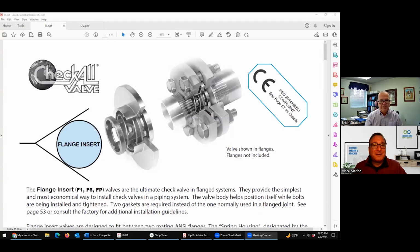As you can see here on the cut sheet, on the left, there's an image of the check valve. It's got a cutaway area so you can see how the poppet works or the check mechanism. It looks almost like a flying saucer, if you will. But what it does, on the right picture, is sandwich in between ANSI class flanges, which are standard connections in a piping system. Again, you have these flanges, so you don't have long rows of pipe that you have to replace. You'll put these connections in different spots so that if you need to replace pipe, you don't replace as long a section. What we do is we put a valve together that can sandwich in between that, so it fits nicely in there. You don't have to reconfigure the system. You can just open up the flange, put our check valve in there, and now you've got a check valve that's working in a very cost-effective installation manner.